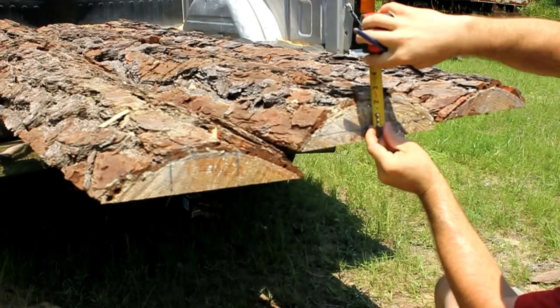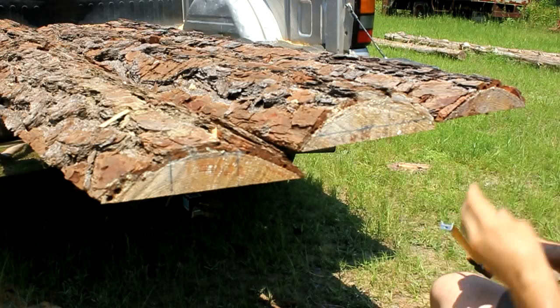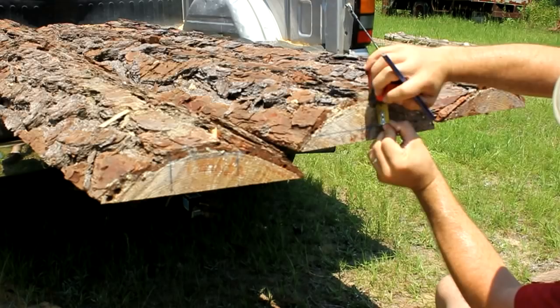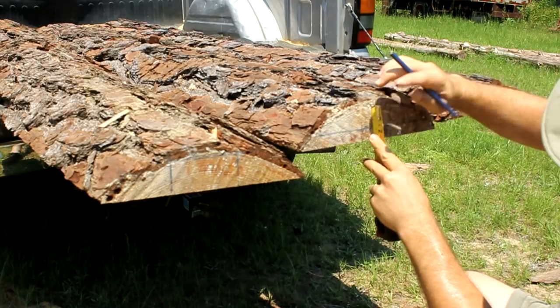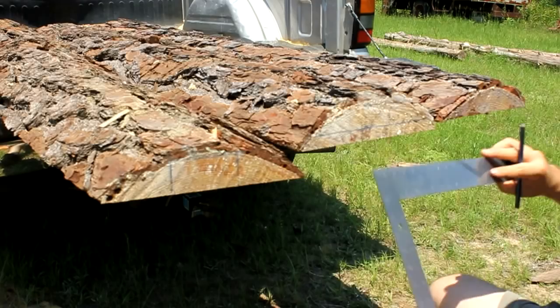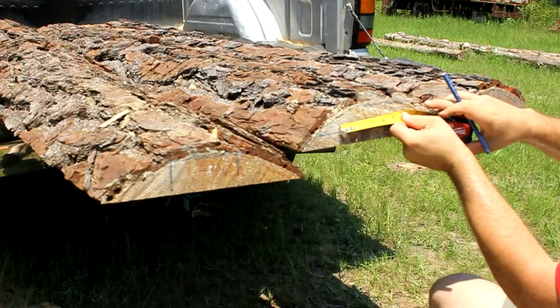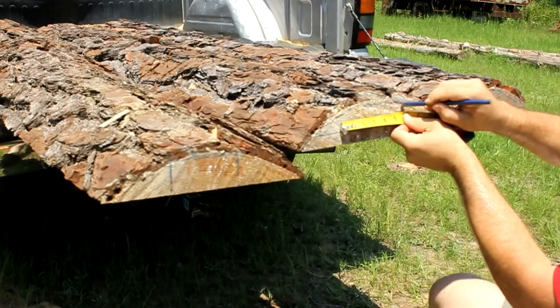I think we've got enough that we can call this a store-bought 2x6. So let's measure up 1.5 inches and get this to work. Let's do this instead. Let's measure up 1.5 inches. So we're going to hit it right there. Measure up 1.5 inches. There we go. Go ahead and mark that off, and do our 3-inch mark about in the center. And since we're going to do a store-bought 2x6, we'll do it at 5.5. So we'll put 5.5 over here in that mark there.